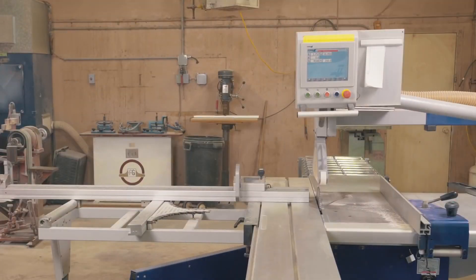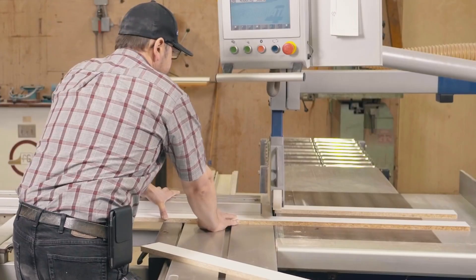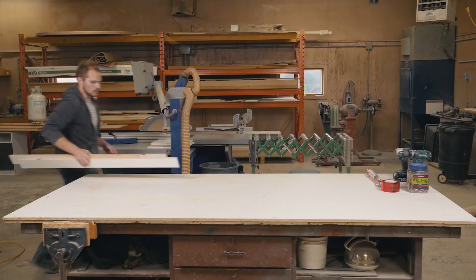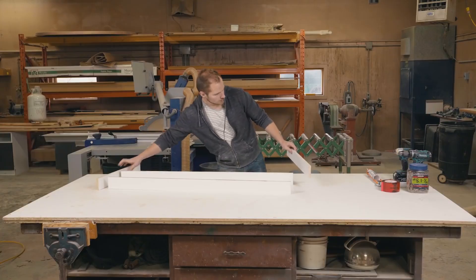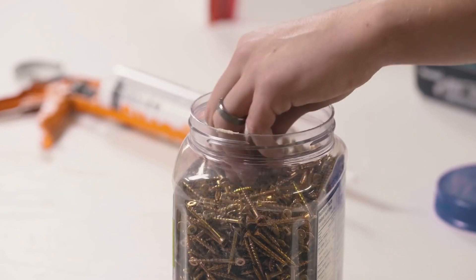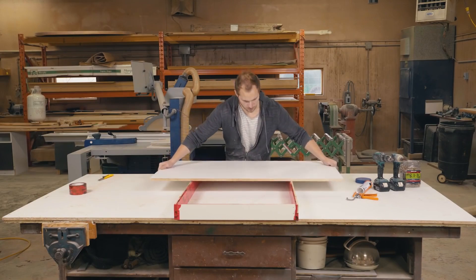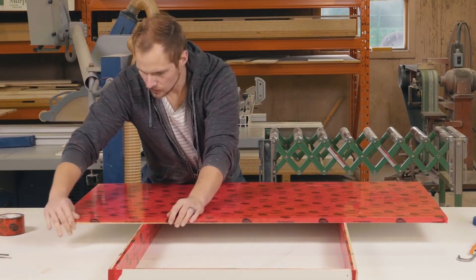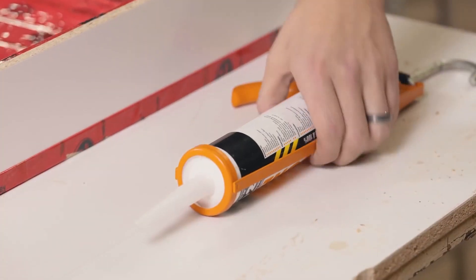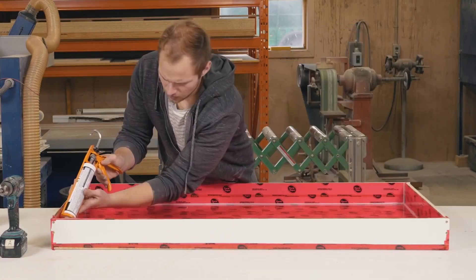Now it's time to start building the mold. Cut the base and side pieces to your desired dimensions. We used melamine, but MDF or plywood will also work great for this. Make sure the sides of the mold are at least half an inch taller than the thickness of the slab, to avoid any overflows during the pour. Cover each piece of the mold with a sealing tape, like this red tuck tape. We recommend using screws to put the mold together — this will help when it comes to removing the mold later. Apply a bead of silicone to the inside corners of the mold. You could also tape the edges, but silicone is easier to apply and better at creating a leak-proof seal.